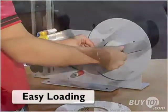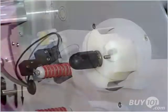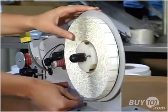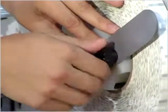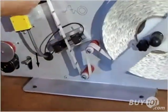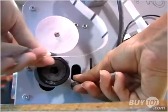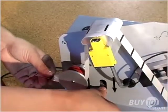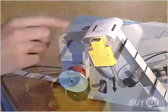Loading the EconoDot is easy. Loosen the supply reel spindle located on the supply reel bracket and remove the supply reel bracket. Load the Glue Dots roll onto the supply reel, ensuring the liner runs in a clockwise direction. Replace the supply reel bracket and supply reel spindle. Pull the liner over the first roller, under the second roller, up through the U-channel sensor, and over the nose plate. Press down on the spring-loaded lever located to the right of the motor-driven and clamp rollers to create space between the two rollers. Thread the liner between the separated rollers and release. Pull on the liner until a single adhesive pattern comes to rest on the nose plate.